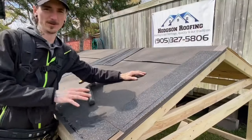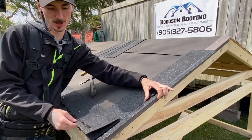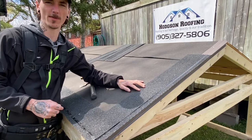Now that I've reached my far end gable, you can see I've put my bottom eave starter on but haven't nailed the end yet. The reason for that is I like to drop this one down, and as you can see I still have full tar adhesion all the way around the corner of the roof.